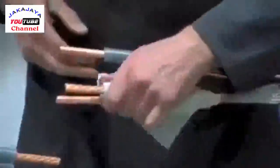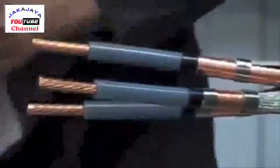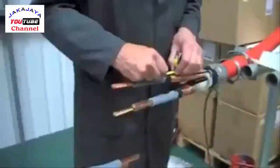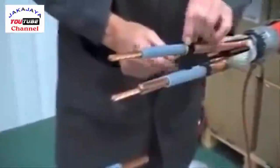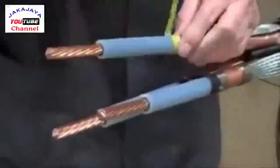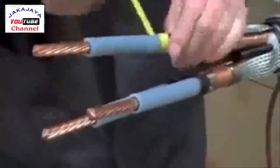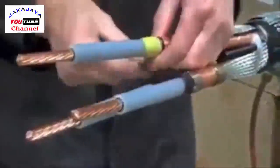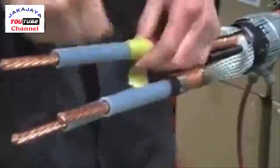It's really important to clean the primary insulation layer. Use the tissues provided or a suitable solvent — all carbon traces must be removed from the primary insulation. Now take the yellow stress relieving mastic, apply with a thin edge, stretch and extend onto the primary insulation by 10 millimetres, back onto the semi-conductive layer and just catch the copper tape screens to keep them in position. This mastic tape will also provide a moisture seal when the stress control tubes are fitted next.